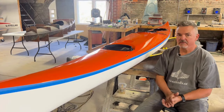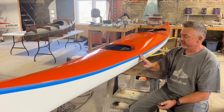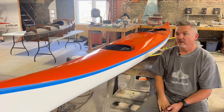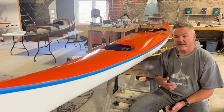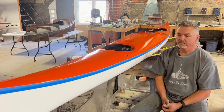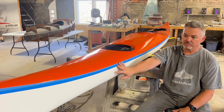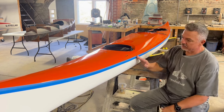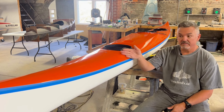So I've gone through and ground the seam down nice and flat. This is another reason to do it before laying the tape — it allows the tape to lay nice and evenly on the surface so you don't get any line undulations. With this going to be a black seam, you're going to notice every single wave in the tape line as soon as you pull it all off. So everything's been prepped as far as the joint is concerned, and this tape serves as a guide when we mask off the deck and then the hull.